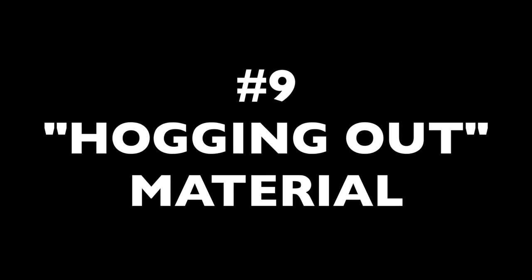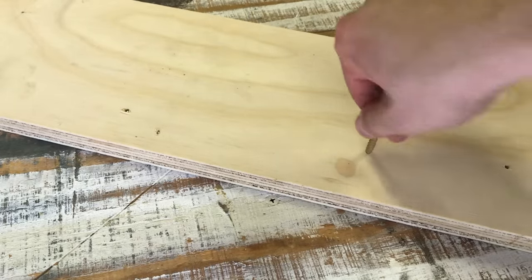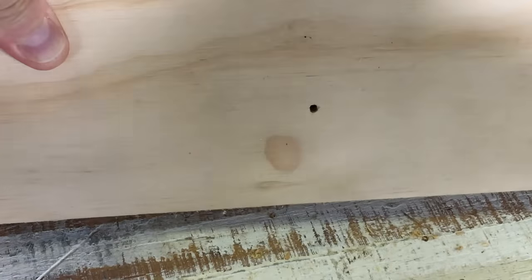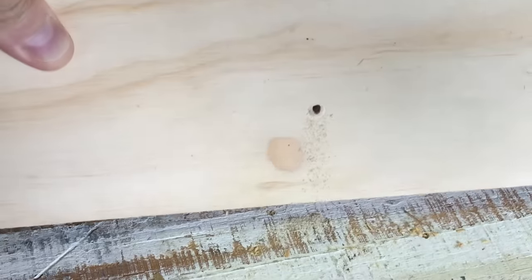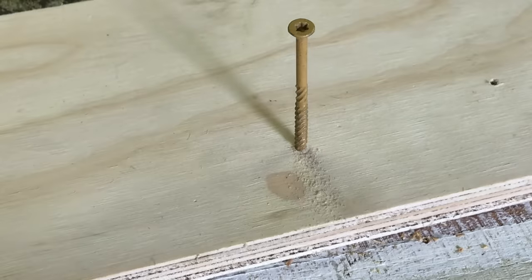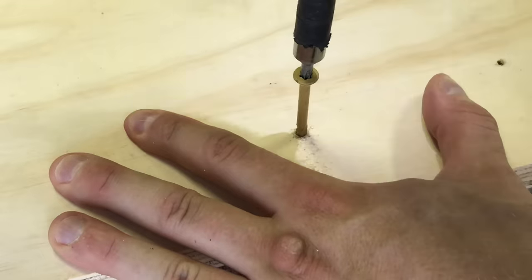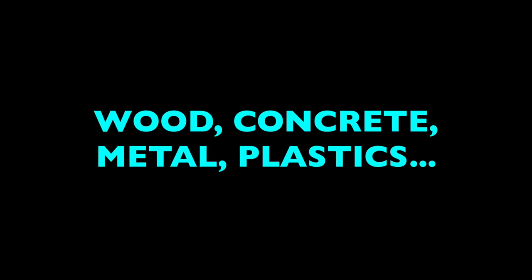Tip number nine: hogging out material. Hogging out is a construction phrase that generally means removing more material by aggressive reaming. For example, say a fastener doesn't want to fit into a pre-drilled hole but you don't have the next size up drill bit. You can sometimes get away with running the same drill bit through the hole several times, slightly enlarging it in the process — just keep the bit spinning, working it forward and backward, making sure it contacts the walls of the hole. Try not to angle the bit too much, as this can deform the hole drastically. Before you remove too much material, test the fastener to see if the fit is improved. It's very easy to overdo things this way, but hogging out is a common technique used on job sites for widening holes on short notice — and that includes in wood, concrete, metal, and even plastic.